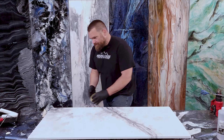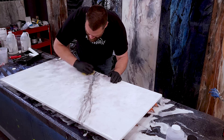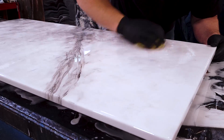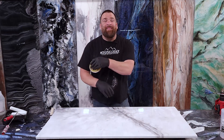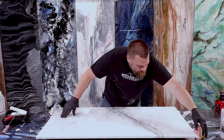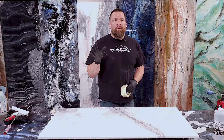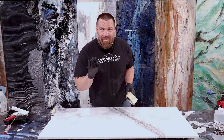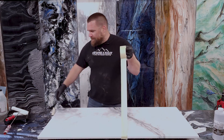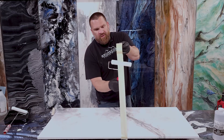Time to sand. Like applying a clear flood coat, lightly sand with 220 grit to rough up the smooth epoxy so the ultimate top coat will have a great bond. Finish off by lightly hitting the edges with that 220 grit. Remove the sanding dust with a roll of paper towels. Before using brand new microfiber rollers, de-lint them with some masking tape — hook it to your piece and while on the roller cage, give it a quick roll.